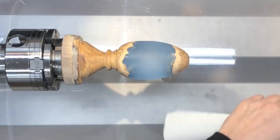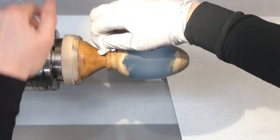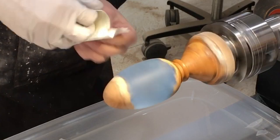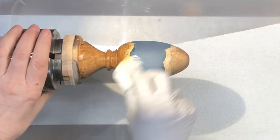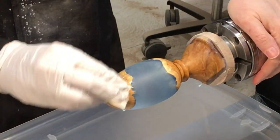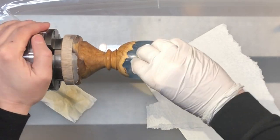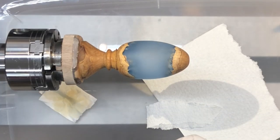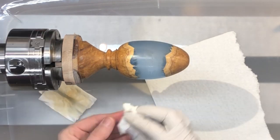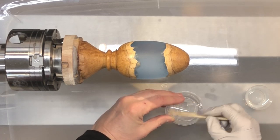I put a coat of one-pound shellac on just the burl parts. The resin I'm going to use for the top coat is Alumalite Amazing Clear Cast, and it recommends that you seal the wood because any porosity can potentially cause bubbles in your finish. I did dry this wood in the turkey roaster and I think it's pretty dry, but just to be safe I went ahead and did that. This is denatured alcohol, which dissolves shellac, and I went back over because I got a little bit on the resin - I didn't want any shellac on the resin in case it would interfere with the way the resin top coat looks.